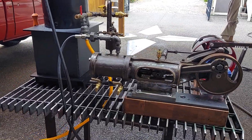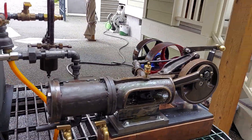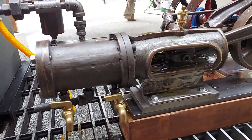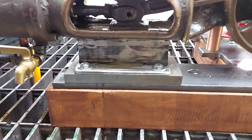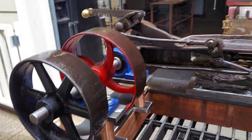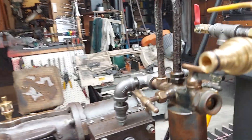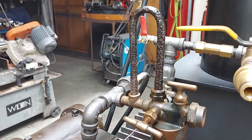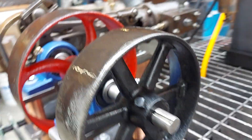I've got a really nice antique engine here that I've rebuilt. Two and a half inch bore, three inch stroke. I built a new base for it — hardwood base, mahogany I think it is. Runs like a top. Beautiful little antique swift oiler on it. Two antique pulleys.